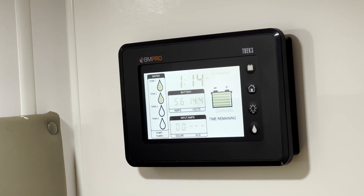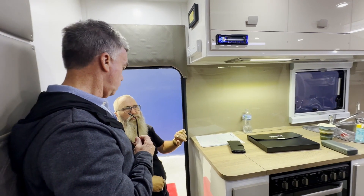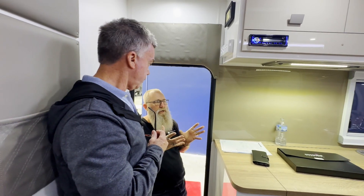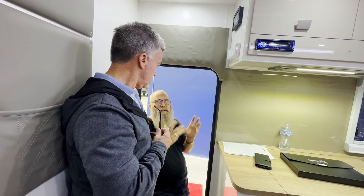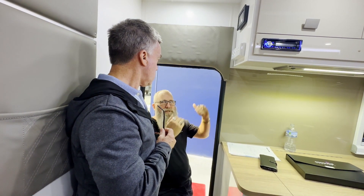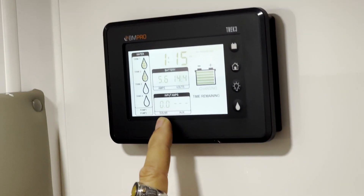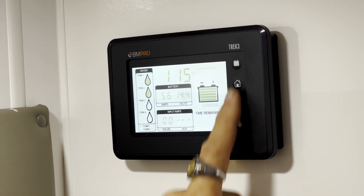If you're not getting enough sun, get more solar in with the auxiliary panel, plug your car in with the Anderson plug to charge it, run your car to charge it back up, or plug into 240. With solar, the key thing is UV light — direct sunlight is what they run off. Dirt, dust, bird poo, cloud, and rain all affect your solar production, so keep panels clean and out of shade. It's all about production versus consumption — you can see how much is sitting in the battery, how many amps are going in from solar, and the same with the auxiliary.